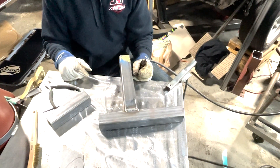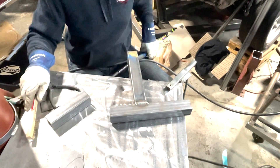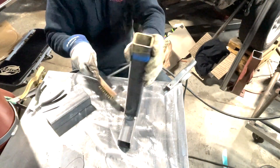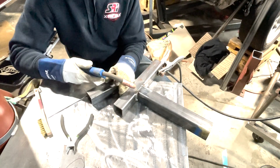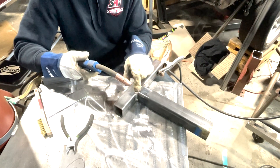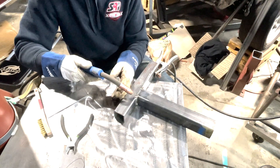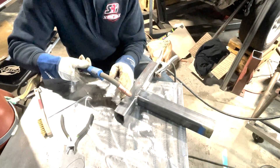Here's a bird's-eye view of the weld. I can see a little gap where my tack was, so I'll pop a little more material in there. Now for a bit of fun I'll push this side — same sort of thing, bouncing across the gap rather than aiming directly at the air inside the tube. The air inside is hot; if we really wanted a super clean job we'd purge the inside with argon. But what I need to realize is that the hot air might push back on me just a hair before it ventilates, so we'll just be careful.